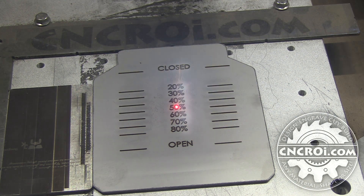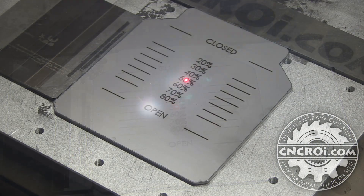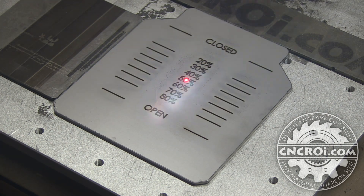At the top of the video you can see a lot more of that debris. We do a lot of plaques using a variety of methods and processes. You end up with a very fine powder — the same sort of thing you get when you plasma cut in a shop. It's no different, just stainless steel. We can do the same process with mild steel, aluminum, titanium, or any metal. It's a little tougher on hardened metals — we do some aerospace projects where the metal is hardened and it takes a lot more power. You can definitely see the difference between a very hard metal and a soft metal when doing this process.